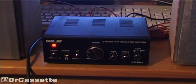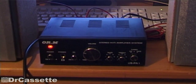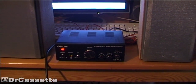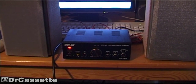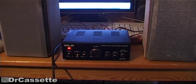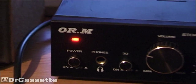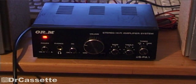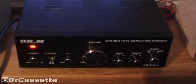Now I want to do what I just described. And there it is, all back together. I fixed all the problems that I noticed and installed that new filter capacitor. It did improve the peak power output a little bit. You can always tell when a power supply is at the end of its capabilities — when the power LED starts going dim — and the point at which that started to happen did shift a little bit, so it definitely improved something.